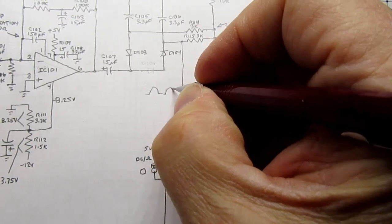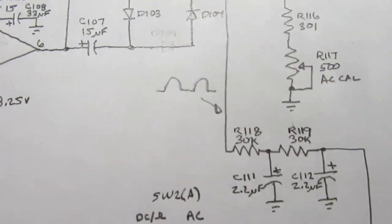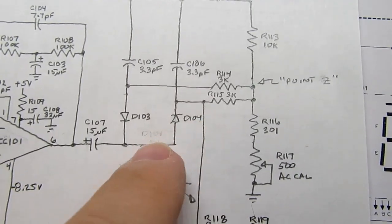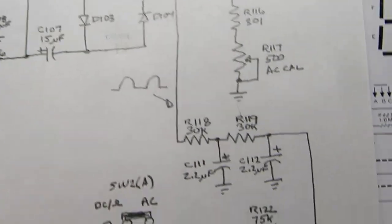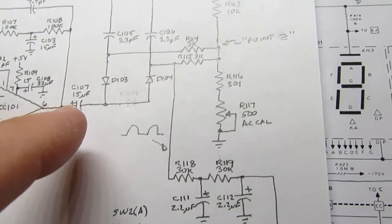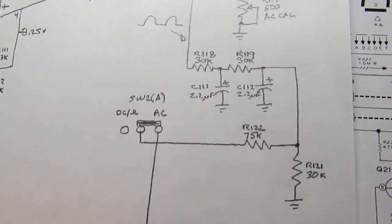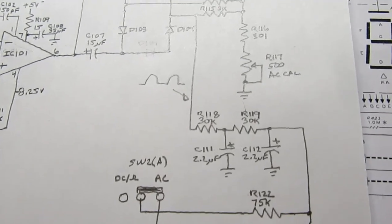looks like that. There is no negative component to it because we're only looking at the side that you get voltage there when this diode is forward biased on a positive signal. You could just tap off the negative one too. It wouldn't really matter as long as the circuit downstream is looking for the right thing. And the downstream circuitry here is looking for a positive voltage.